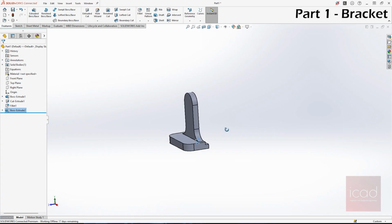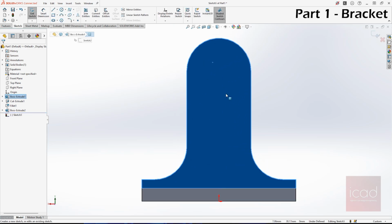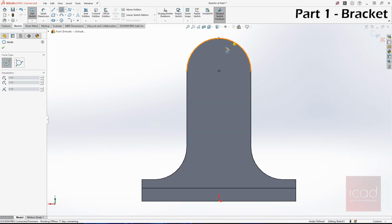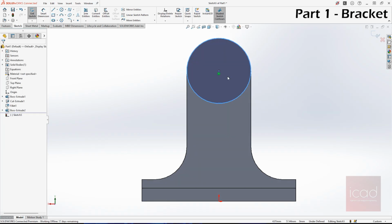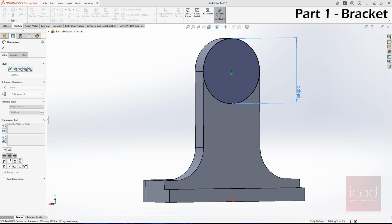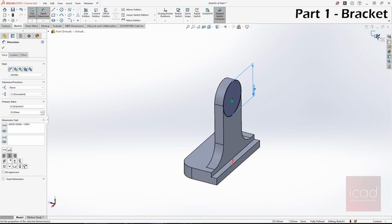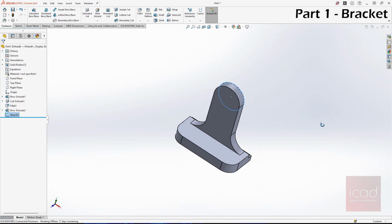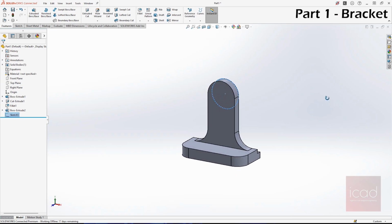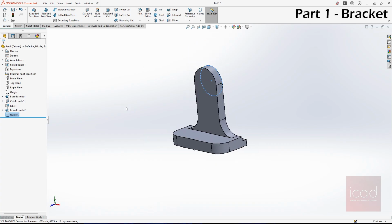And next thing is, before I make the holes or ribs, there is another extrusion on this side. We know that it was already 8 mm extrusion. The overall extrusion of the particular circle that I'm going to draw is 13 mm. This is a 30 mm diameter circle. Yeah, and it is concentric with the fillet or the curved surface here. Now that I think, there was one more way without using cut, I could have done this. I did not give it much thought at that time.